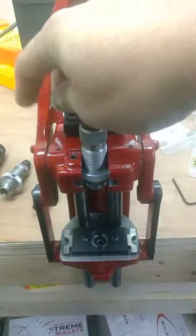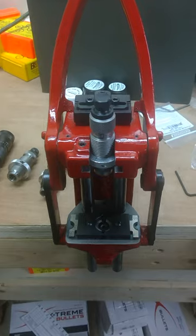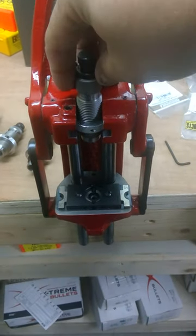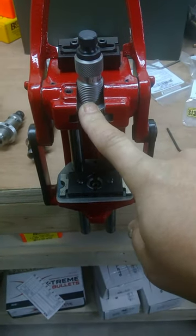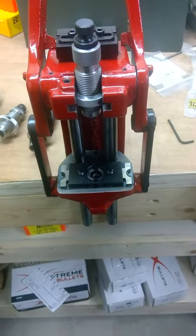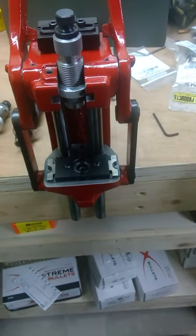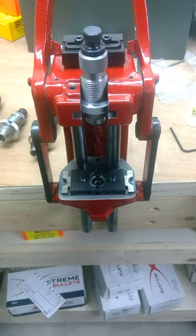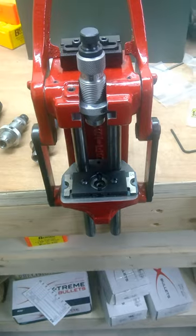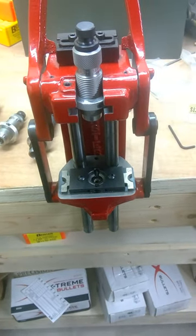One of the other things that's really nice is that you'll notice that die has some wobble to it. Why is this important? A lot of guys say they don't want their dies moving around while loading — stuff needs to be tight and set exactly where they want it. Well, your length is set by this collar here, so you don't have to worry about the die moving up and down at all. The reason you do want the die to float just a little bit is so that when you run that piece of brass up into the bottom of the die, that die is free to move around to exactly align with that brass. So you get very, very little runout on your cases. I have a Hornady runout gauge and checked the runout on ammo loaded on this press — I was getting ammo that was spot on or had like .001" of runout. It was incredible.